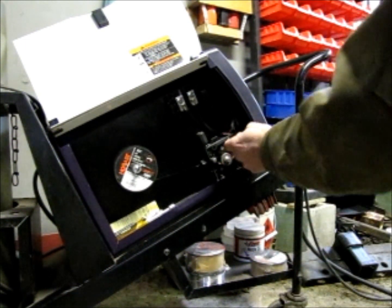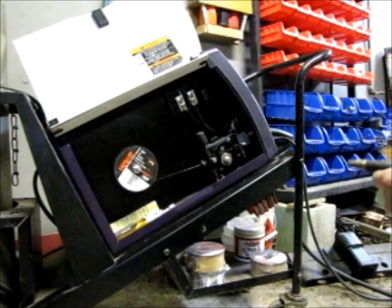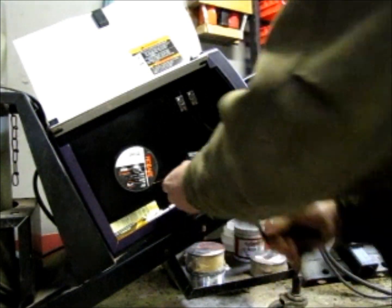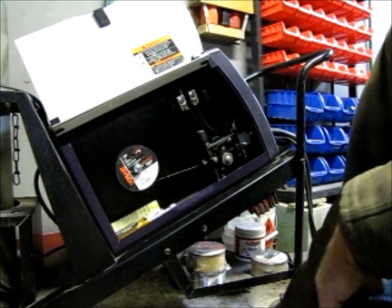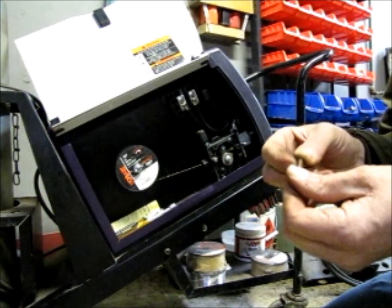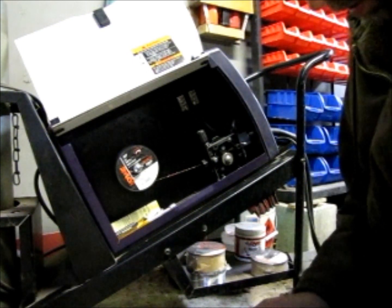What you're doing is watching to see the wire come out the end of the gun. There's a spot in the gun I think — what happens is I turn down my feed speed so it doesn't get quite so hard, down to about half. Okay, I got the gun working again — we got some wire sticking out. Get it out enough to put your new tip on. I make sure that my old tip is still okay in order to decide whether I want to keep it or not — that looks fine so I'll put that back in the container. I get my 23 thousandths tip out.